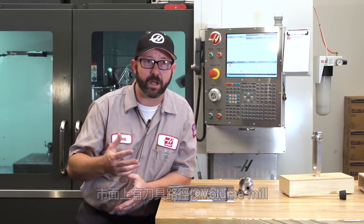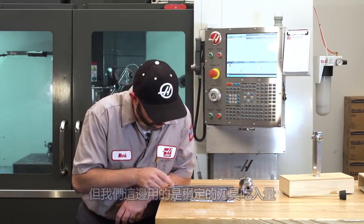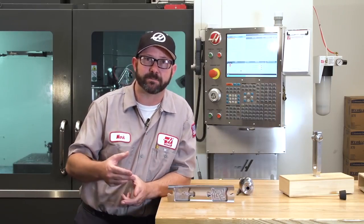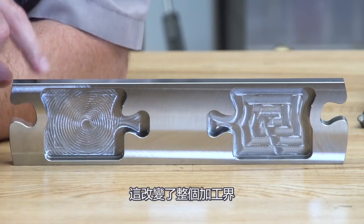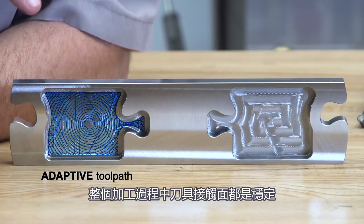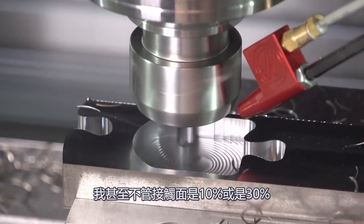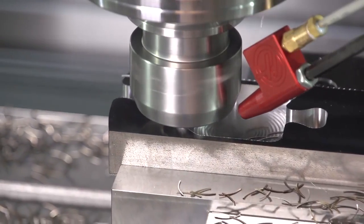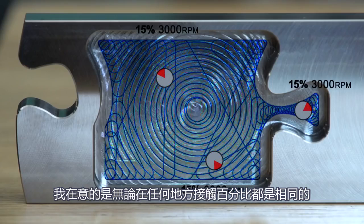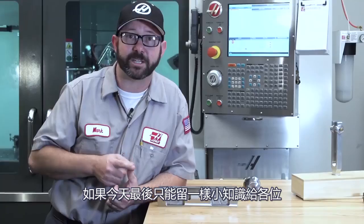This is the beauty of newer tool paths — adaptive tool paths, dynamic tool paths, tools like volume mill that base a tool path on chip size. What we're doing is giving ourselves a constant tool engagement, and this is a game changer. Using an adaptive or dynamic tool path, our tool engagement is constant throughout the entire pocketing operation. I don't care what that engagement percentage is — 10%, 30% — what matters is that the tool load isn't changing. Once I find the perfect RPM or feed rate, I can stick with it through the entire pocket. If I only had one bit of information to give you today, it would be this: find yourself a CAM system that has a modern high-speed machining tool path with constant engagement.